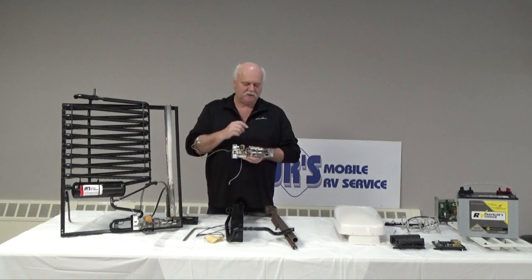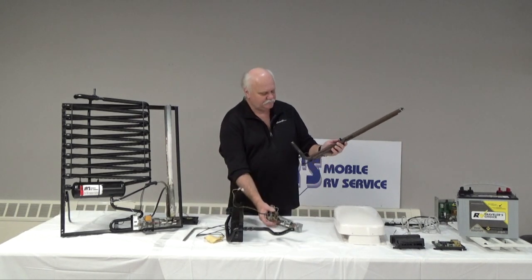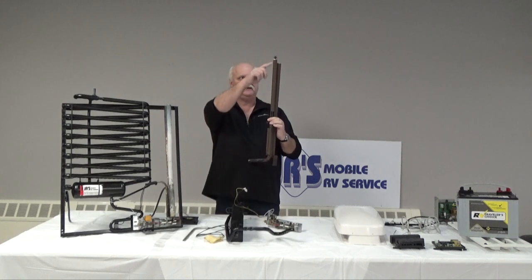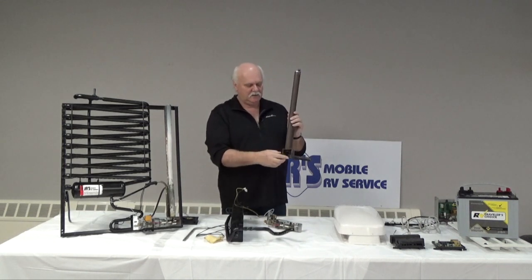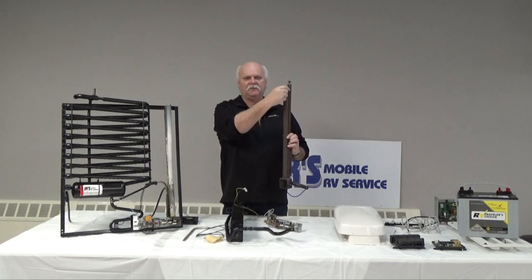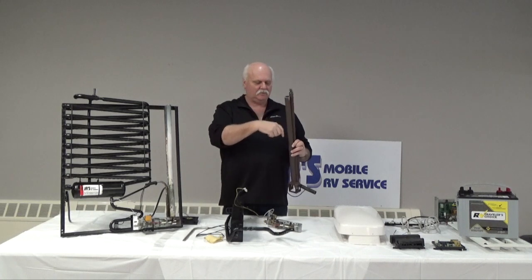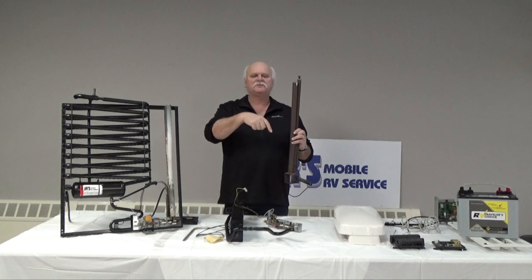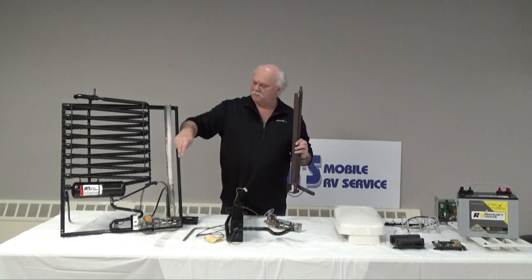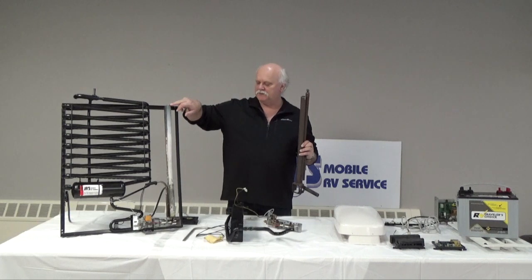This is a cutaway of what the actual burner and everything looks like. In this cutaway, these pipes are attached to the pump tube and create the heat this way. When it's on propane, the heat then travels back up through the chimney here on this side. In here is what I call a fishing lure. It just looks like a spiral lure, and it's dropped inside this piece of the pipe. The purpose of that is to slow the heat being transferred up through the pump tube here.